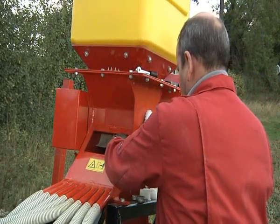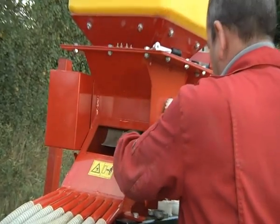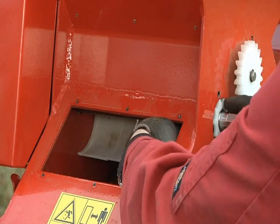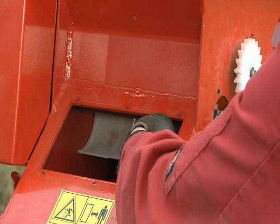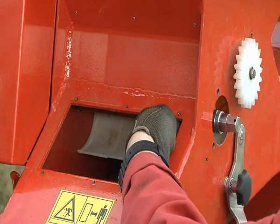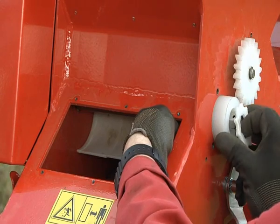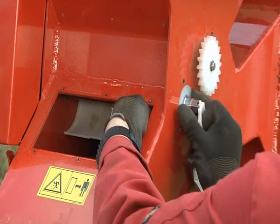When changing seed rollers, it's important to check their sufficient tolerance to allow the spacing segments between the fluted rollers to spin freely by finger pressure. If the rollers are too tight, it may result in seed being driven between the spacer and seed control flap, over applying seed.